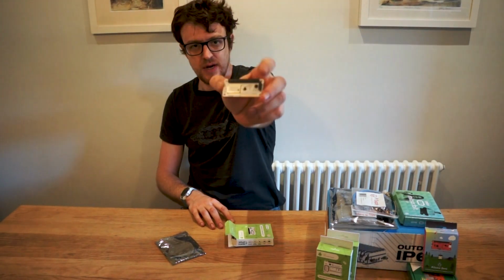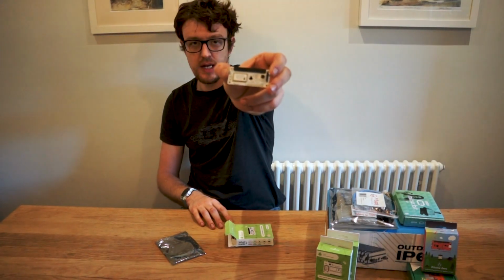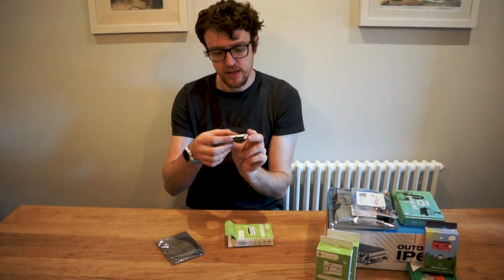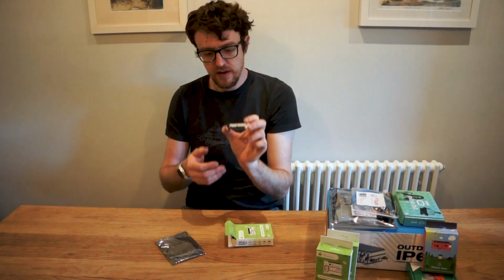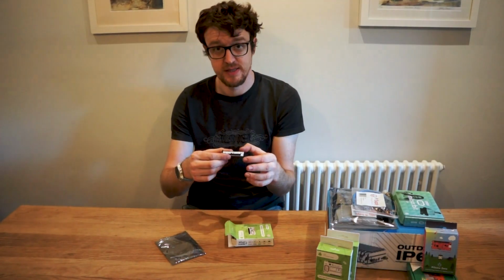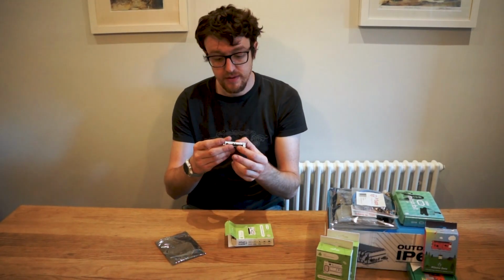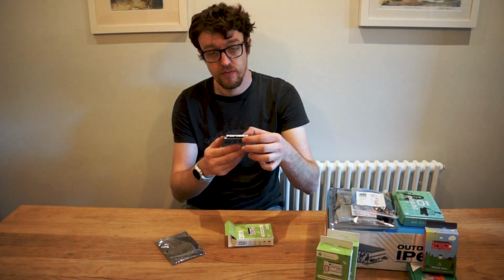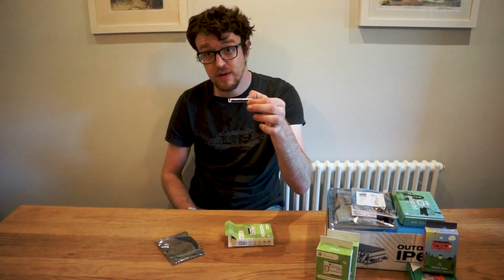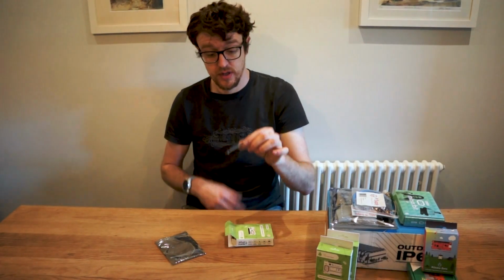So you can see it uses a RAK811 LoRa chip there, system on a module really. And yeah, it's got the 40-pin header. This header, you can see, is super low profile. If you pair that with a Raspberry Pi Zero, and this is the same outline as a Raspberry Pi Zero, 65 by 30 millimeters, so quite small, you can then just plug this on top of the Pi Zero's header, and I think it will sit about 4 millimeters away, so it'll be a super, super small LoRa node